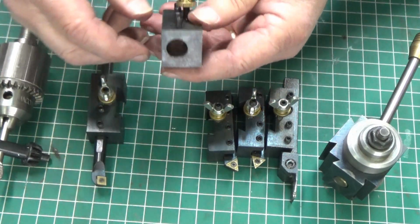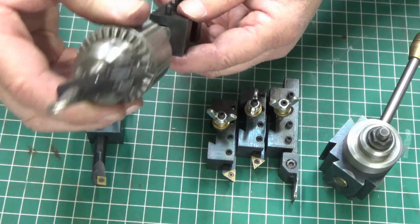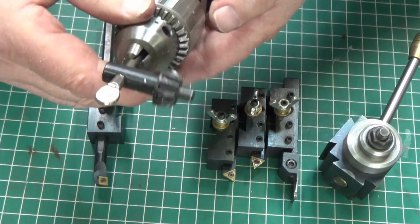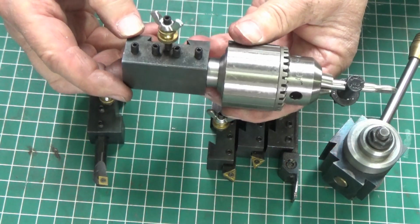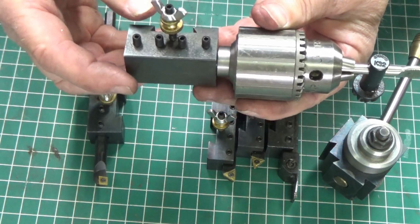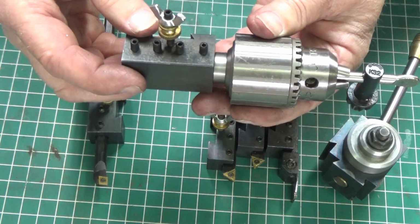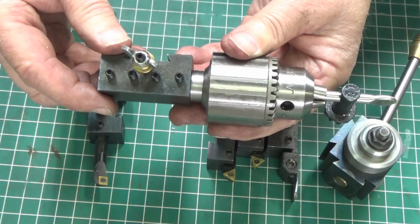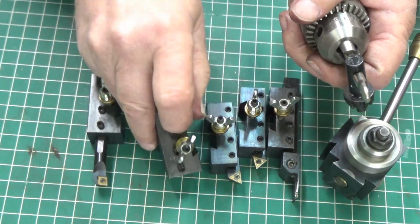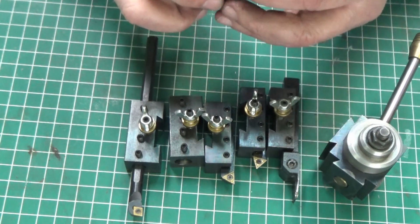Here's one for a 1/2-inch boring bar, and I also made an arbor for this Jacob's chuck that will fit in that, and I use that for drilling, deep hole drilling on the Atlas lathe. Matter of fact, it's one of the more popular ongoing videos that I've got on the channel, deep hole drilling on a small lathe. And I'll leave a link to that in the description also. I said it doubles for a 1/2-inch boring bar also, and then I built one for a 3/8 boring bar. And I still use it to this day on the 6-inch lathe.